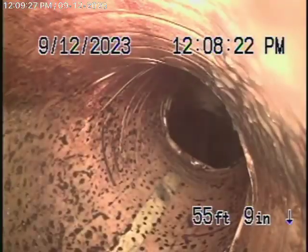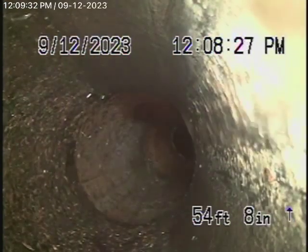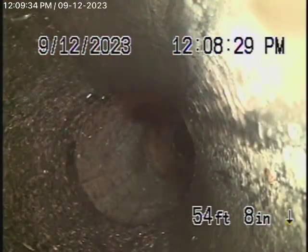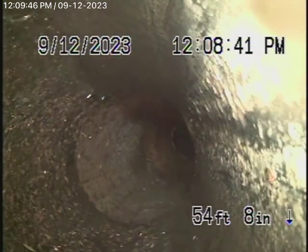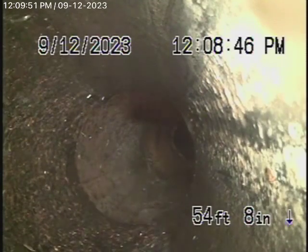So we're going to bring the camera back. It looks like the city has a lining, and you also have a cured-in-place pipe lining — a very short run — which is in good condition as of today. You can see it's nice and clean. If at some stage there ever is a problem, which is highly unlikely because the sewer line has a very good grade going downhill, you would never want to run a cable with a blade through a lining, although it's probably never going to be needed.